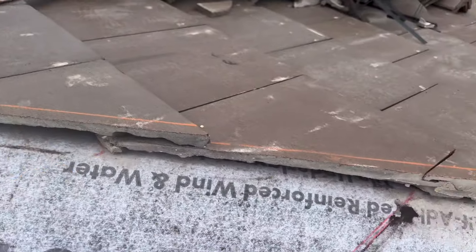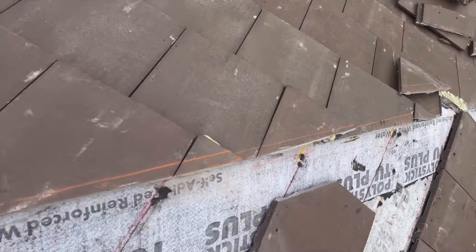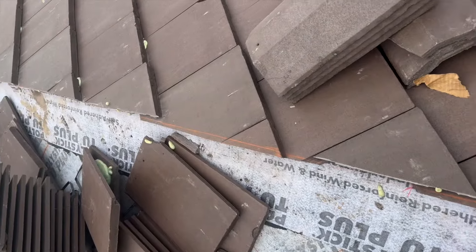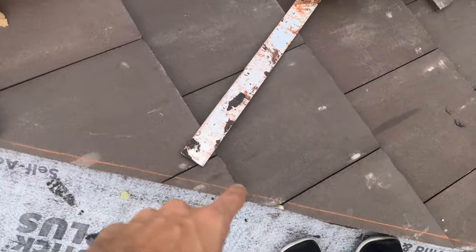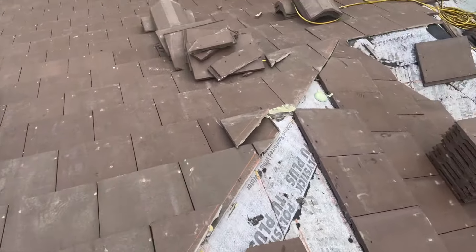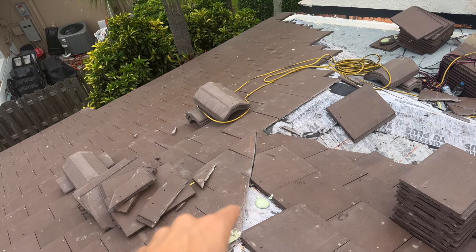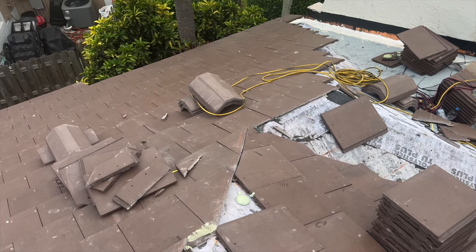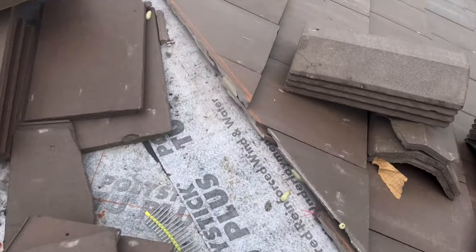There's no hip metal on this hip, so the tiles are cut perfectly straight. You can see the line that the guys cut to make sure we have straight cuts. You can actually see when I stand directly above it how straight it is, right down the hip. There's going to be a gap that gets backfilled with concrete, but you want smaller gaps, not larger gaps.